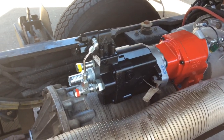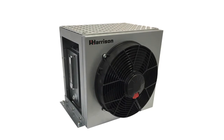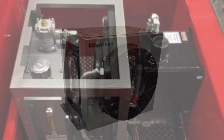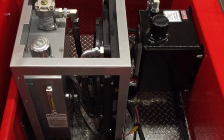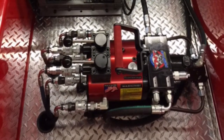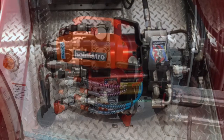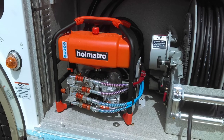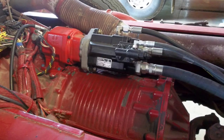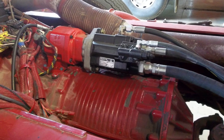Bolt the Harrison hydraulic pump to the PTO. The Harrison HydraCube contains the reservoir and heat exchanger needed for the hydraulic system; it must be installed in a location that's easily accessible to service at the recommended intervals. Mount the partner's product so it's easily accessible for service and adjustments. Hydraulic hoses will run from the hydraulic pump to the hydraulic reservoir and to the partner's product.